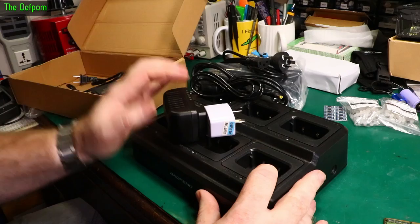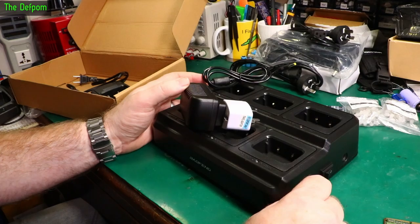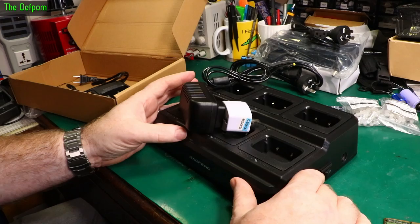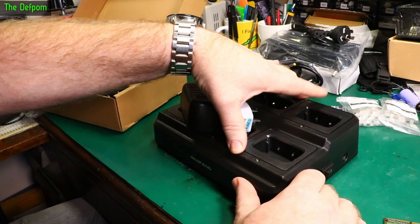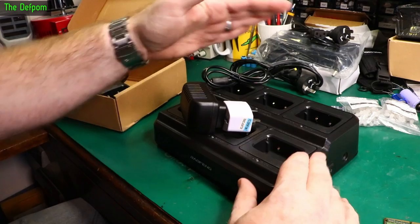Obviously I've got these chargers, but they're not quite going to do the job because I've got the wrong socket on them. I can deal with that — change the connector on here. Now I can use one of those or the 5 volt one, because that's what it requires — 10 amp, 5 volt. Plenty of grunt for this thing. I won't be stressing anything. I always over-spec things. I was expecting about 5 amps, maybe 6 tops for this thing, which is why I've got a 10 amp charger. So it's got plenty of headroom — it's not being stressed to the max.